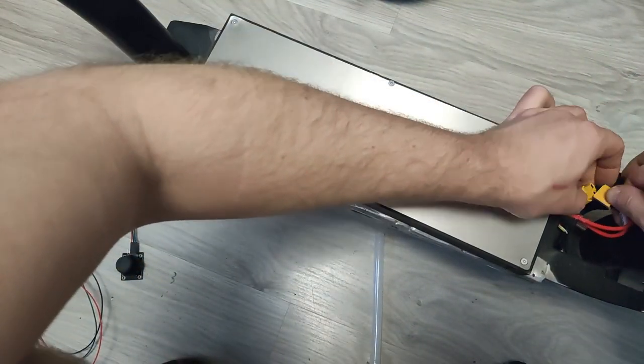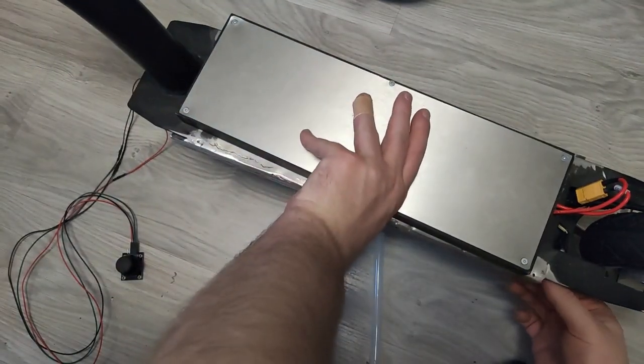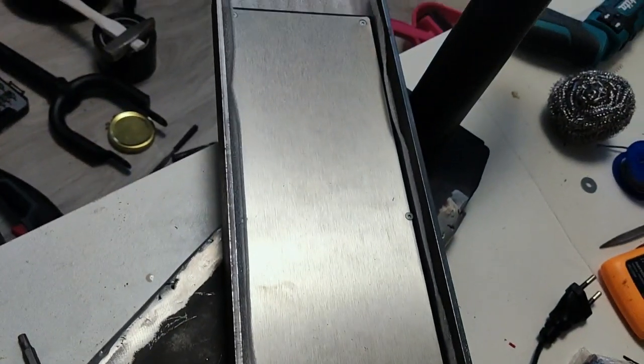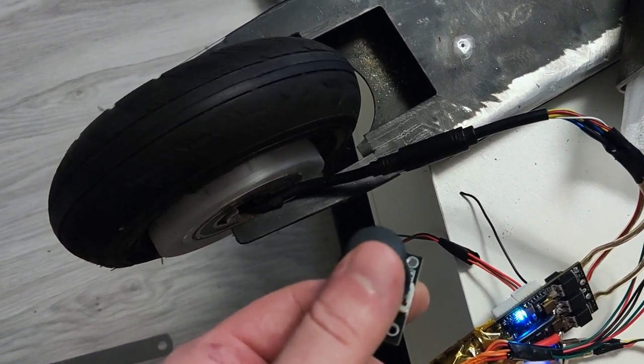Unfortunately that meant scrapping all the work I had done to fit the longboard motor — neither my 3D printed rim nor my hot glue filled tire would get any attention. But I decided to talk about it anyway, because maybe you can learn from my mistake. I suspect that originally hub motors for longboards were used in pairs, so using just one halves the torque. Not only did I use just one, but I also increased the wheel diameter twice, so technically my scooter had one quarter of a longboard's torque.